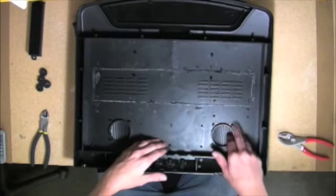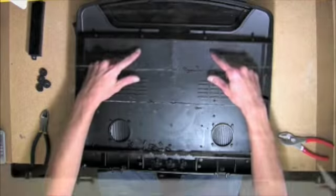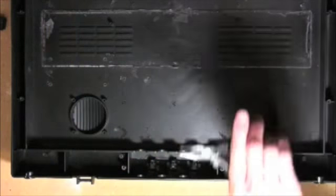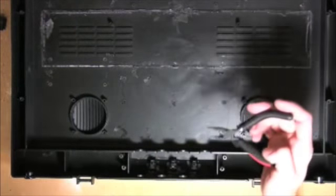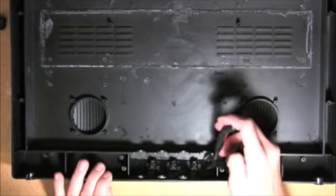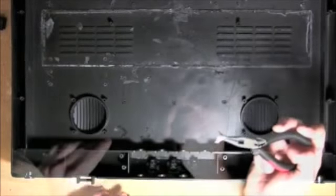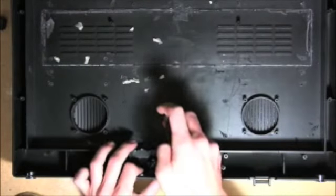This time, take note that the standoffs around the fans as well as the four above for the mounting points are still in place. Using a pair of needle nose pliers or a similar tool, remove all hot glue that is surrounding the stock power switches at the back of the canopy. The two switches on the right will be removed and replaced with new switches.